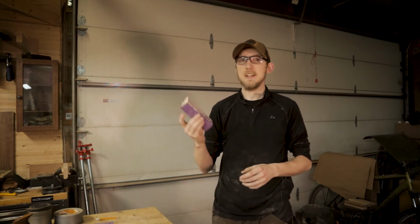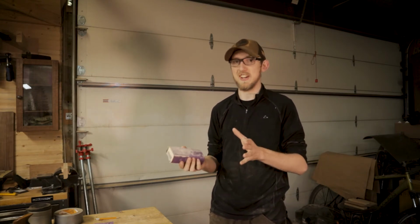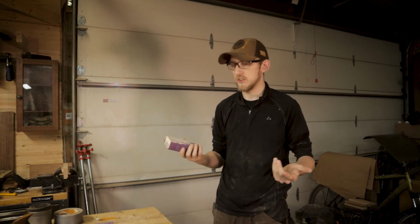And so when I'm getting ready for finishing, I like to blend the traditional and the modern techniques. The hand plane does a really good job of getting the surface really smooth and clean and removing any plane or tear out, all that kind of stuff really quickly. And then the sanding lets you work in any direction you want, whether that's chaotic grain, whether it's just nice, clean, straight grain. The sanding works just fine to clean up any of the leftover stuff left by the hand plane.